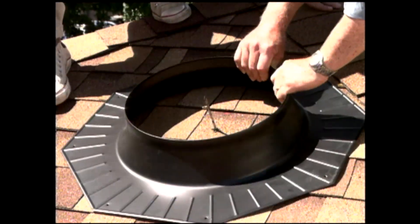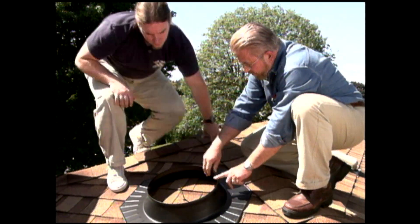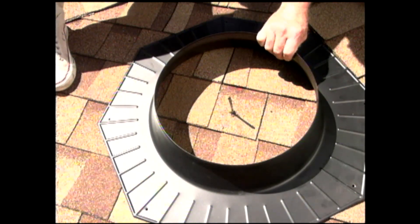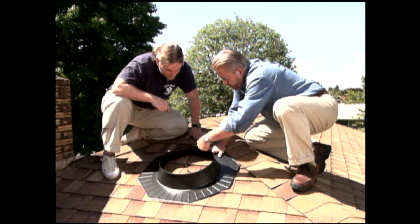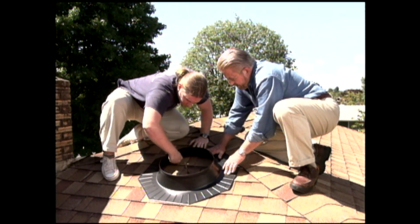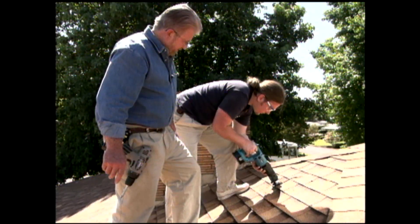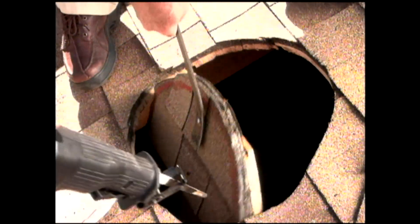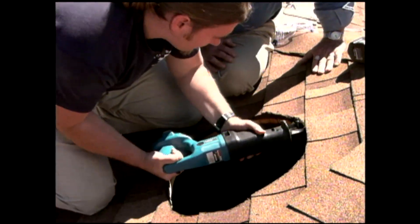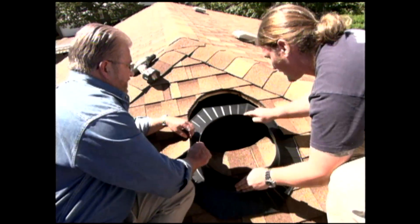William, this is the flashing that eventually the skylight dome is going to attach to. Right now I want to get it centered over that drill bit. With the flashing centered, I use a lumber crayon to draw a circle on the inside of the flashing right up next to the edge, all the way around. The flashing acts as a template for the opening we'll soon be making. Next, we slip the reciprocating saw under the shingles and cut the roofing nails around the edge of the hole. This will allow us to slip the flashing underneath the shingles.